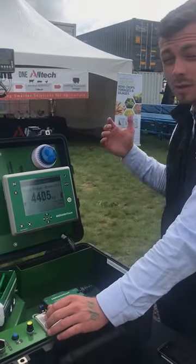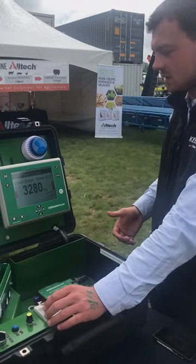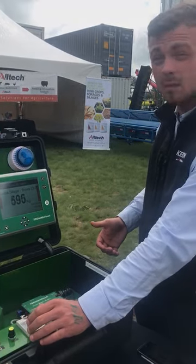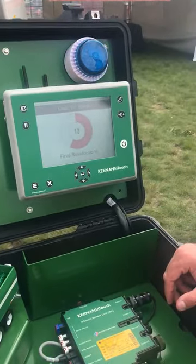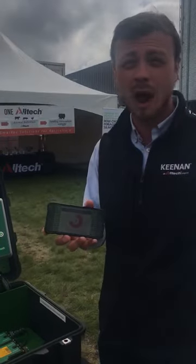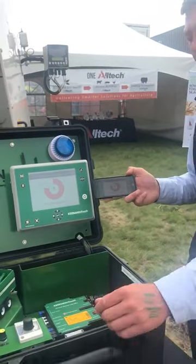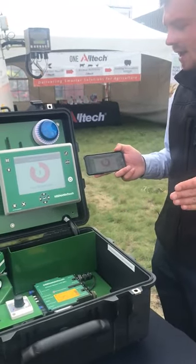Making sure that we're maintaining that consistency for the counts each day — reciprocating it as if we were loading into the mixer here today, loading buckets of the ingredients as well as coming out of the monitor. You can see the numbers are counting down. We actually have a revolution counter that counts down to ensure that you have the proper mix. Everything can be accessed through a wireless app available on iOS devices — Apple — as well as Android. The revolution counter is making sure that you're making the same mix consistently every day.